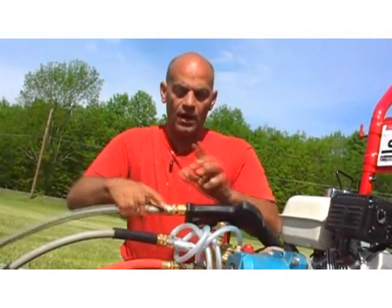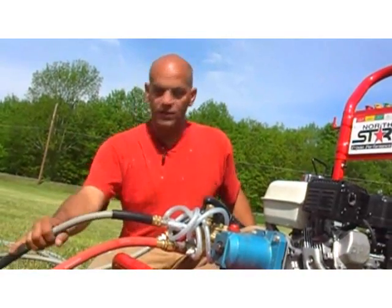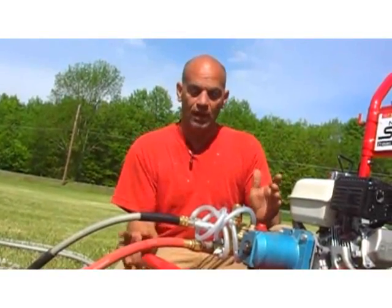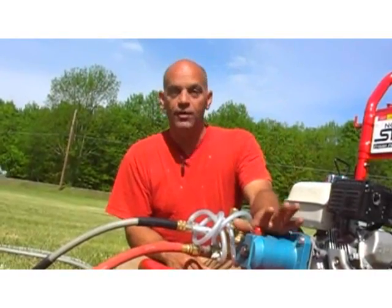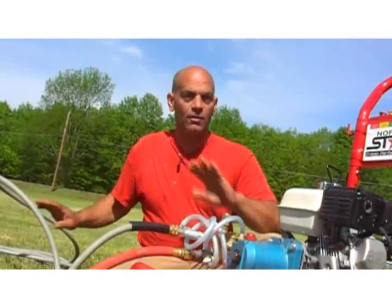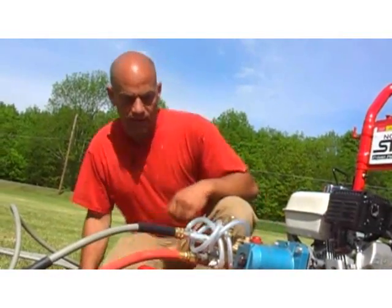Well, I went ahead and connected our garden hose to it. We got the rest of the pressure washer hose connected to it. Now what we want to do is actually turn the water on and let all the air come out of the hose, the pump itself, and of course our pressure hose. You want to make sure it's all out of there. All right, so let me go and turn that water on and we'll get going on that.